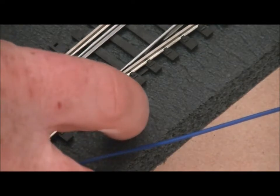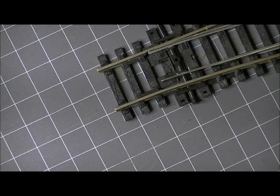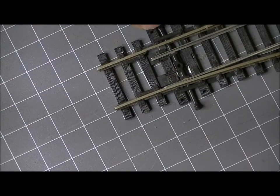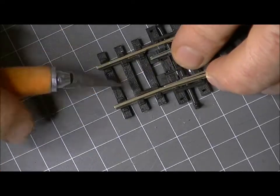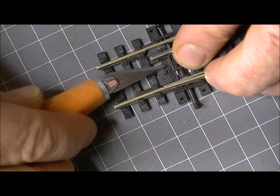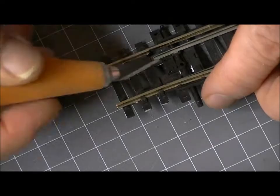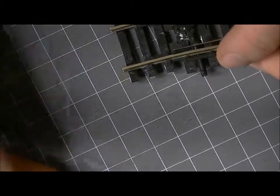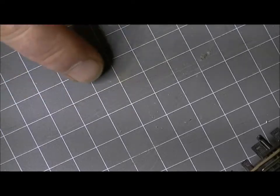So before we remove the spring, it's click, click. Okay, so what we're going to do now is remove the spring that's underneath this plate to stop it going click, click. So you just need to get something nice and sharp. Some of them have fold down tabs here and here, and what you have to do then is fold them up. But I've noticed lately that the latest ones don't. They just sit in like that. And you can just see this little metal spring. So that's our little spring out.